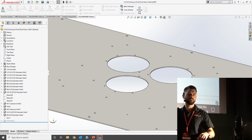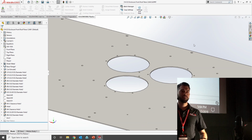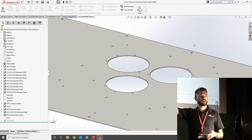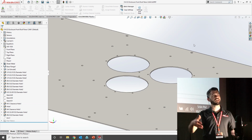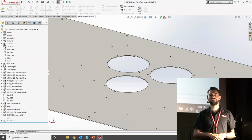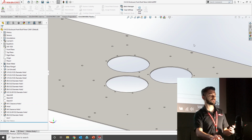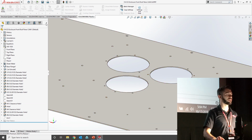What happens to the material in the middle, right? Probably sinks to the bottom of our water jet, right? So if we're basically cutting out those circles and the material's falling away and it's sinking into our water jet, we're not going to see it again for maybe a year or 2, depending on how much cutting we do when we go to clean out that water jet. So another option that we've got where SOLIDWORKS CAM can help out is a new option called tabs.